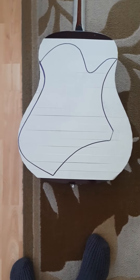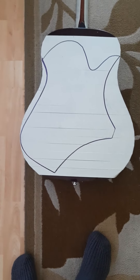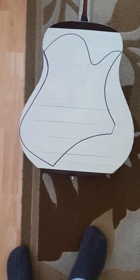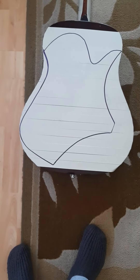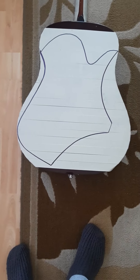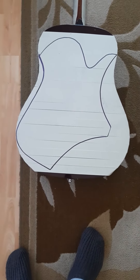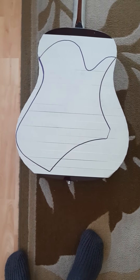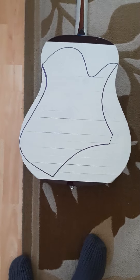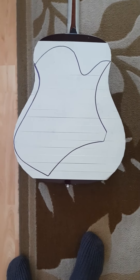Here's a quick update. What you've got here is just some masking tape across the back of this guitar, and then I used my template to create an outline that I will later cut using a scroll saw — a handheld scroll saw. I'm not going to cut right to the line; it'll be a little bit proud of that so that by the time the template is applied and everything routed, I'll have a little extra material hanging over.